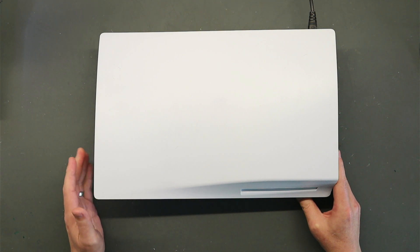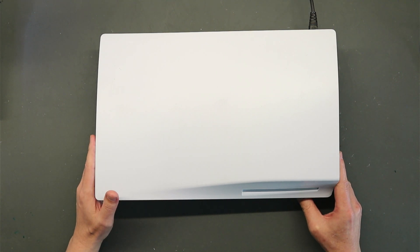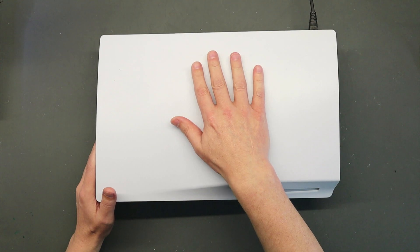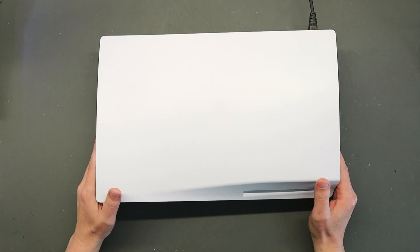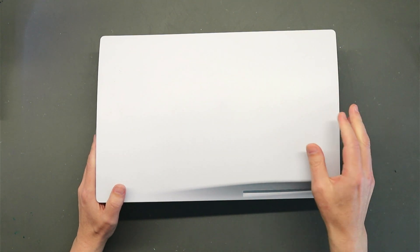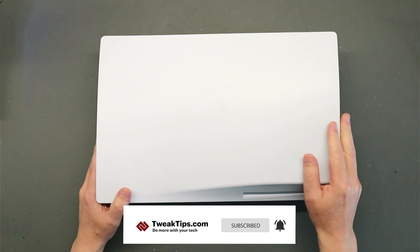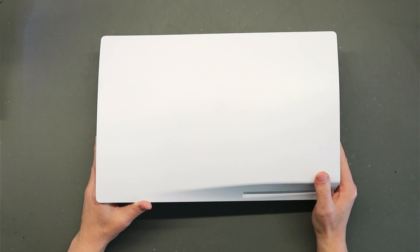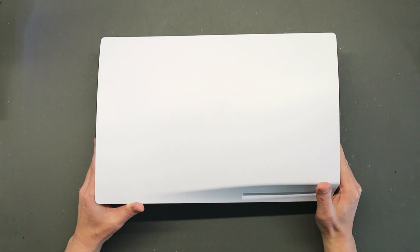Quick recap: this console had been worked on previously. The HDMI port had been poorly attempted and we replaced it correctly. The blown fuse F7002 was replaced, and the power IC had also failed so we replaced that too. That covers how we diagnose and repair no-power issues on a PS5. Hope you found it useful — please give us a thumbs up and subscribe as we post videos every week. Thank you and take care, see you soon.